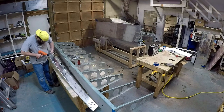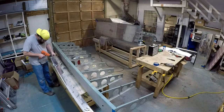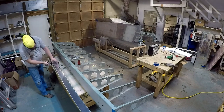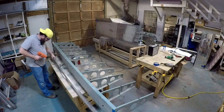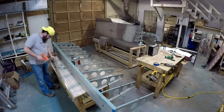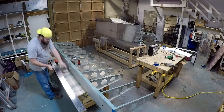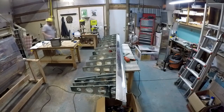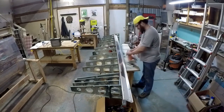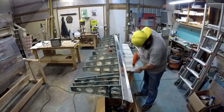Now here I'm working on the aft spar for the wing. This will attach to the aft portion of all the ribs, and there are several doubling plates you have to put in place where the mounting brackets and hinges are for the aileron support brackets — things that just strengthen it in certain spots. So I'm drilling and match-drilling all the holes for the brackets and doublers, and at one point I've got to cut out the hole that the pushrod will come through to actuate the aileron. That's kind of where I'm at now. My next video will basically show finishing up that aft spar and getting the wing ready to put the leading edge on.